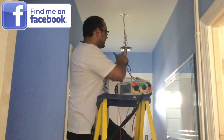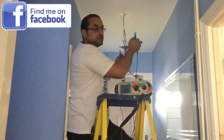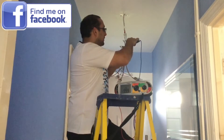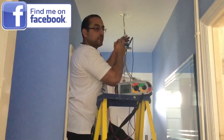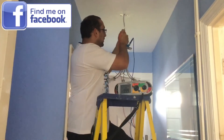We're looking at this metallic light fitting. This is the part I'm most concerned about having the connection, so I'm actually physically clipping on to the fitting itself. What type of conductive part is that? Exposed conductive part. That's brilliant Nick - we're not interested in the CPC at the connector block, we're actually interested in the CPC making contact with the fitting itself. Let's see our reading.